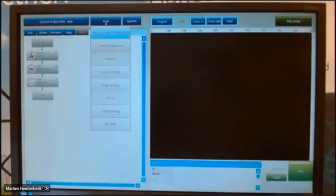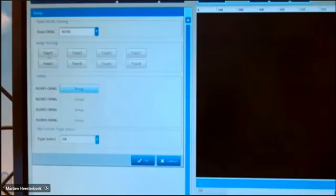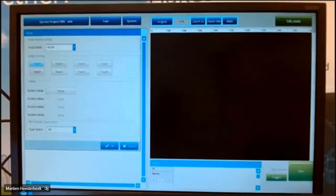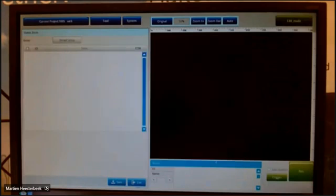The next button is the tool. You have a lot of things what you can do here. You can edit screen, for example, but the most important is the judge setting. On the screen you can have okay, not okay. At this moment, of course, there is nothing inside, but you can connect directly to an output 1 or 2, for example, and you can use the outputs, 8 outputs, you can directly connect to your program itself. And of course, you can also set up in your flow in detail. Finally, of course, when you have made the program, okay or not okay, directly on the screen to your request, what you want to have.